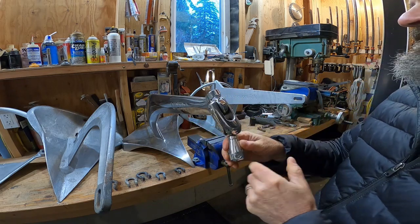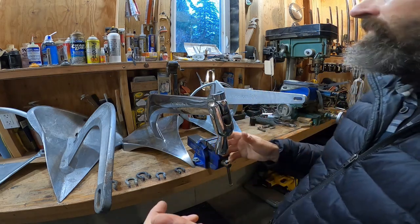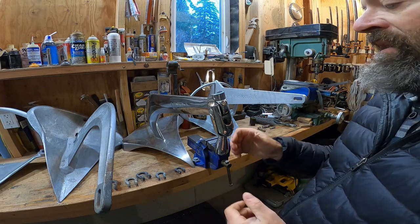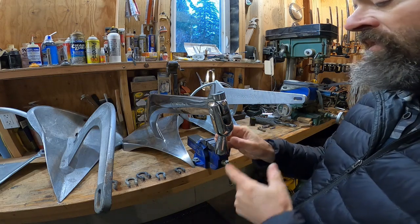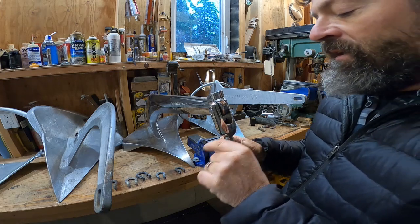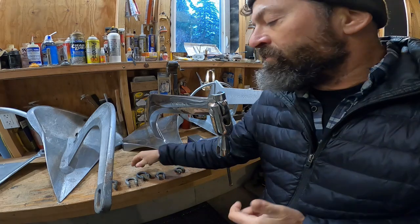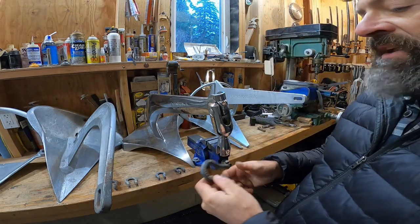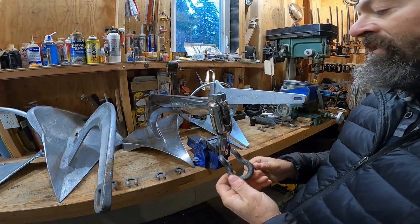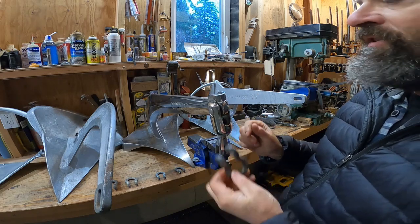It'll pass through openings and anchor rollers nicely, and may even bury into mud nicer than some of the more bulky shackles. For my use — I'm constantly swapping out anchors — fiddling with little allen keys and Loctite is not ideal. I just much prefer a standard good old-fashioned galvanized steel bow shackle, but you can't really use it here unless you use two of them.